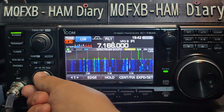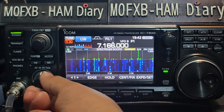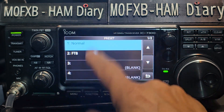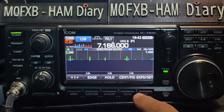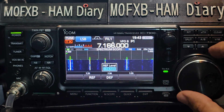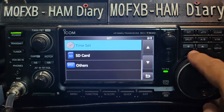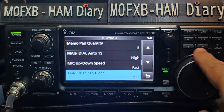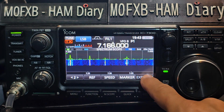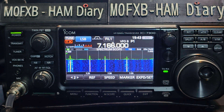It also talks to you — that's your voice guide. Input there: XFC. You've got this menu and number two you've got your presets for FT8. If you've got the latest firmware, tap that and it puts all the FT8 settings in for you. There are different formats of the scope. You click the ref — that's like your waterfall gain. Big set menu, all these connectors and display options. If you really want to change your display, hold down the EXP button. There's a lot to set — this has been changed from default; this is actually the way I prefer it.